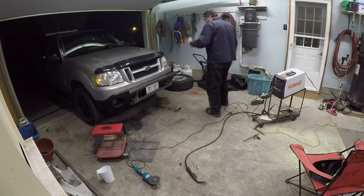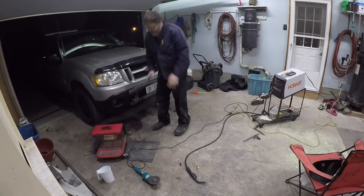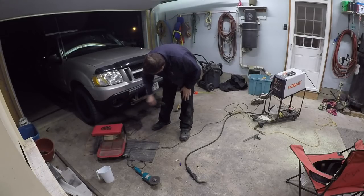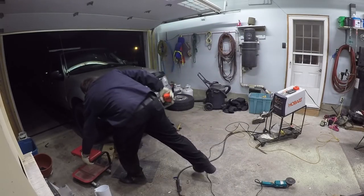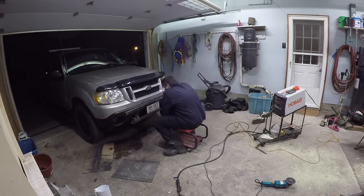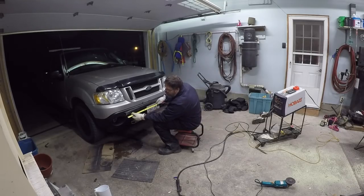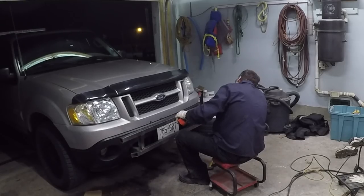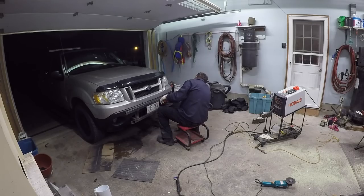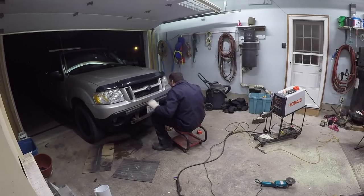Looks kind of freaking nasty just like that though. Frig yeah, it does. This piece, it almost worked for the angle. I could take another one from here and go up... but the light's there, I can't do that. So boys, I got a piece, 52 inches. Now we're just going to get this thing lined up and tack these into place. I'm going to start fabricating the sides and figure out what we're going to do here. So I got seven and a quarter. We're going to come this way just a hair. Seven and a quarter. He's right there. Let's tack that bastard into place.